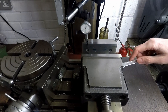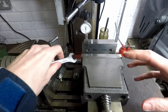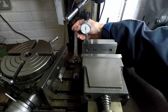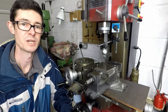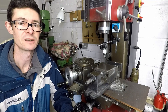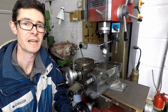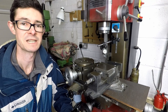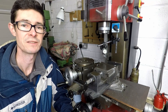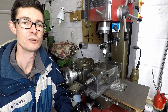So I'm now going to tighten the nuts finally — that's the right-hand one and that's the left-hand one. And that's pretty much all there is to it. That whole exercise took me probably about a minute; I could have done it quicker if I wasn't explaining it to camera. The vise is set up extremely accurately and that accuracy of setup will of course be transferred to the work. Because it's so quick and easy to do, there's no point trying to save time by doing it by eye or by some other cruder method.